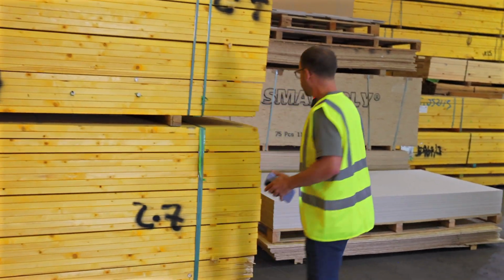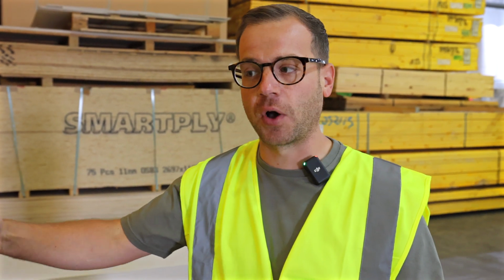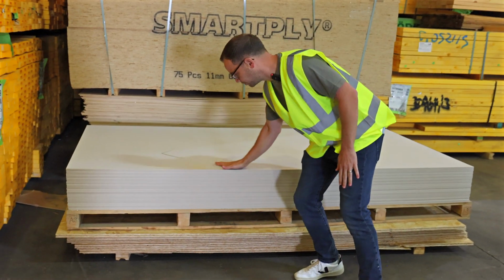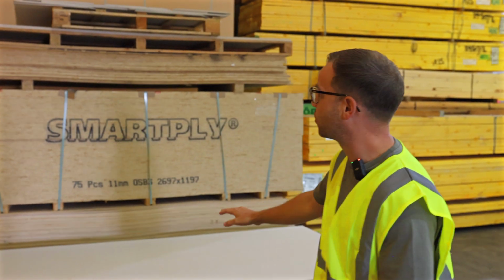If you look here, on my particular properties, because I have neighbouring properties which are quite close in proximity, I had to have a fire report done, because obviously when building the majority of your houses out of timber, there's a higher risk of fire, and OSB is not a fire protective board. So parts of my structure are actually built using a fireboard, which you'll see here. It looks a bit like a cement board. It's still 9mm, and that would slow down a fire massively if there was ever one. So we've got some of that.